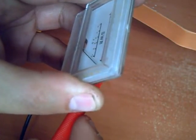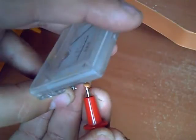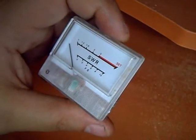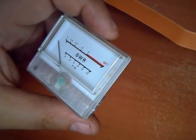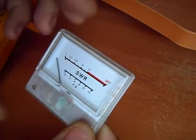As you can see, the needle isn't being set back to zero. The spring inside the needle movement itself is what would reset it back to zero. Now I've reversed my leads, like so, and touched them again — the needle will actually go completely the other direction. So it looks like I'm going to have to take this needle movement apart, take the whole meter apart, and see if it's actually a coil or spring issue. I'm willing to bet the spring which sets this needle is probably busted.